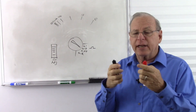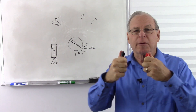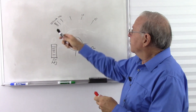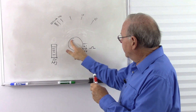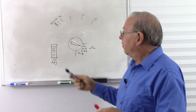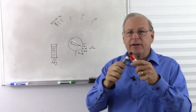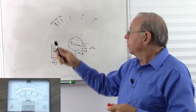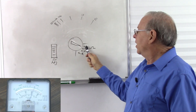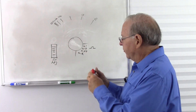Just like a digital meter, if you're measuring a very high resistance, be careful about putting your thumbs on it, because you'll be measuring your resistance too. But low resistances, it doesn't matter so much. So we put the resistor in there and the needle deflects. Let's say we have it set at the times 1 range — 10 ohms, 100 ohms, 500, 1k, and infinity. Touch them together, adjust, put the resistor in. It goes up to 10. We're on the times 1 range, so 1 times 10 equals 10 ohms.